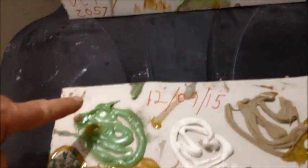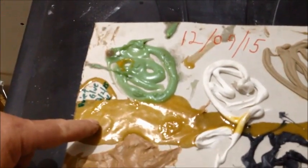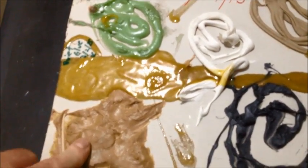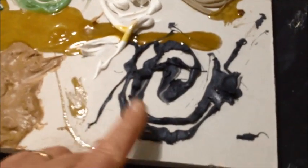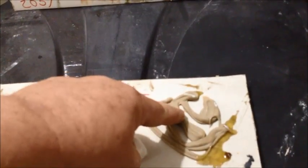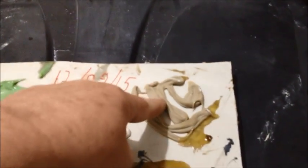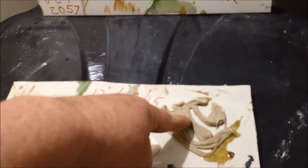We have Green Glue. We have Quiet Glue Pro right here. We have some Roberts carpet glue. And then we have Tremco sealant, the black stuff right here. And then we have another acoustical caulk. And we have Liquid Nails. I can say right off the bat, Liquid Nails, while being probably the cheapest, is the worst. So to the guy that suggested I just use Liquid Nails, I don't think so.